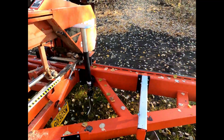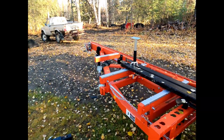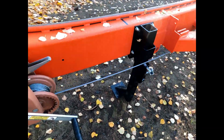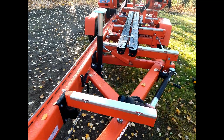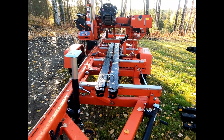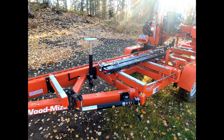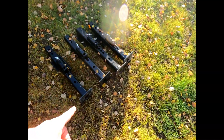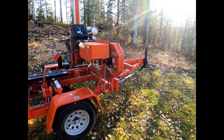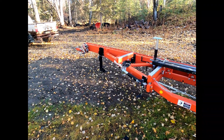What I actually did was take the inner two on the back side and put them on the back and the front, so I still have the offset feet for the width and stability of the machine. The forward adjustable legs in the middle let me set this thing up in about four to five minutes, versus bringing a bucket full of shims of various sizes to put underneath the feet - because you can never get all the feet to line up where you want them and have the machine stable.